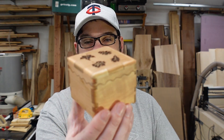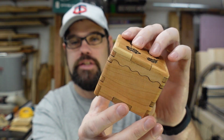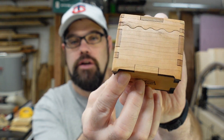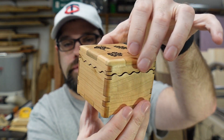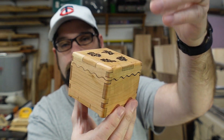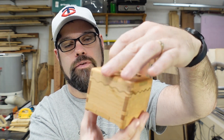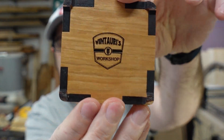After the finish has dried, this is the finished product of the first one. I did go ahead and round over all the top and side corners — I left the bottom alone just because of these curved feet — but it gives it a nice finished effect, and it does show off that engraving. The cool thing about this box is the top doesn't slide off; I can move it around all I want, but you can actually rotate it around and it will sit on the box in any direction. This is kind of a neat little gift box or keepsake box idea that at this size could definitely use up some scrap material.